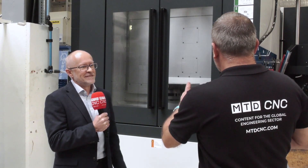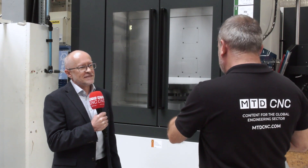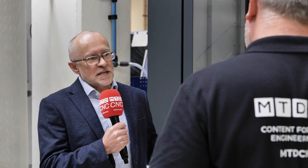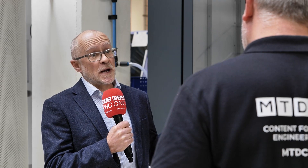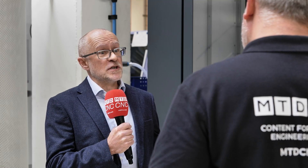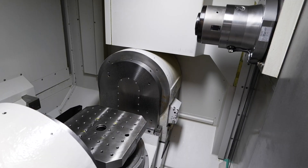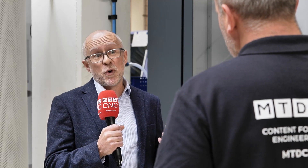And when you look at the configuration of the machine, with the two turrets holding the table, what benefit does that actually give a customer? Well, this machine is a twin pallet machine, horizontal spindle. The fourth and fifth axis are on a trunnion system where the table is balanced and clamped equally at both sides of the trunnion — it's not just held one side or with a drive system one side and a centre the other. So it makes it a very robust, very capable system without losing any of the dynamics, so you can really push the boundaries of metal cutting on this type of machine.